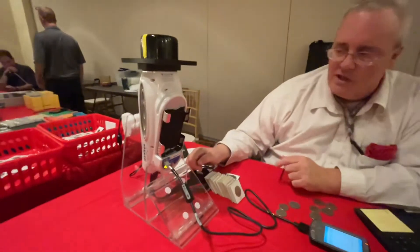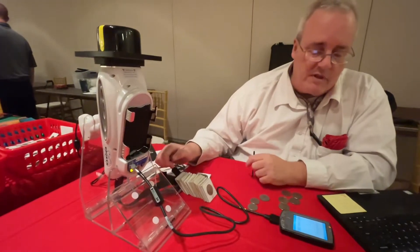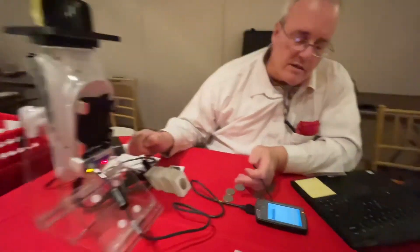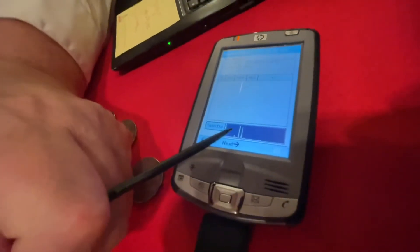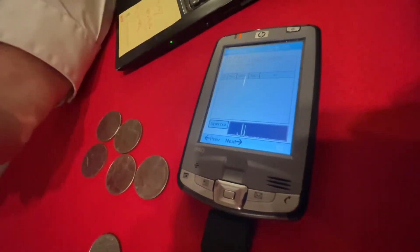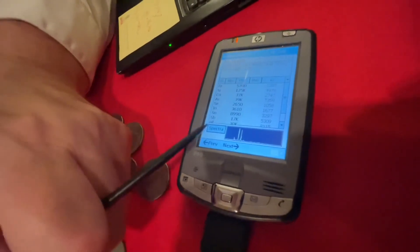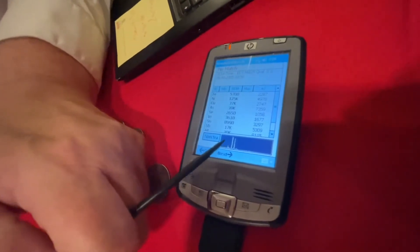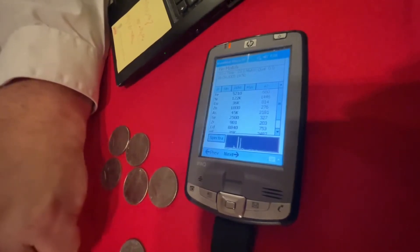I'm Mark Benvenuto and I certainly give you permission to use what I'm saying here and what we're analyzing here on YouTube or any other social media channels. What we have is a United States Kennedy half dollar in the XRF analyzer and we believe that it might be made of lead because it seems to feel different than the others. So we press the trigger, take a look at the PDA readout. Notice that there's two relatively equal large peaks there. If this thing was just copper nickel, like a proper half dollar should be, you would only have one peak and maybe another sort of overlapping it. But the second really big one to the far side is pretty much what I believe is going to be lead.